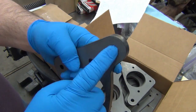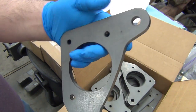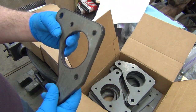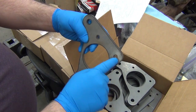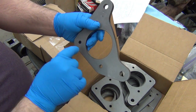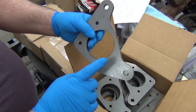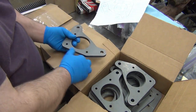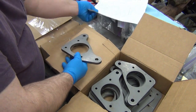All these holes are supposed to be three-quarter inch holes for three-eighths. What I did was downsize them all for the laser cutter so that they act as pilot holes. All I should have to do is get on the drill press and drill through them - I shouldn't have to worry too much about setting up in the mill.